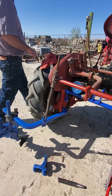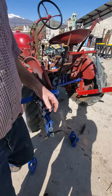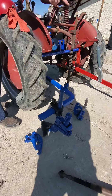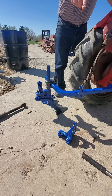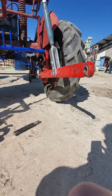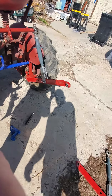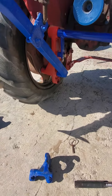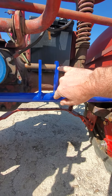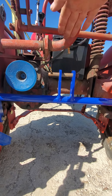I'll go ahead and show you the movement — and it will also go down. That's it. The only thing to watch out for is this distance right here is about five inches center to center, so that the third point comes up right under this lift arm so it doesn't hit. If it's too high, it's going to hit there.